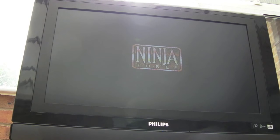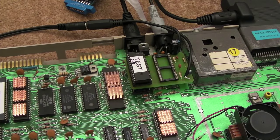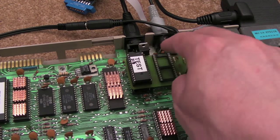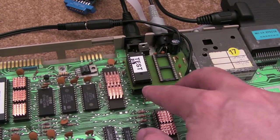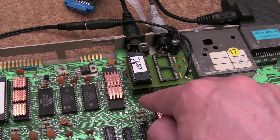That's very interesting — it supported my thoughts. As soon as I saw that behavior, I thought yeah, it's definitely on this instance the problem is the second SID. When I had a problem previously with my original single SID, it was the pins — one of the POTX pins was really crusty, really oxidized. The socket wasn't very good either, so it was no surprise I was getting that problem.